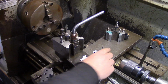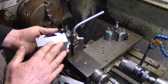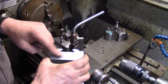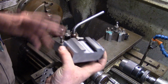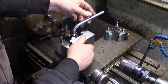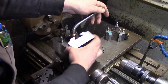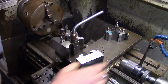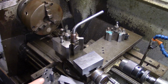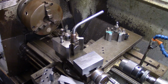But anyway, next video will be machining the tops of these, cleaning them all up, getting them all the right size. We'll maybe surface grind both sides. We've got 4 or 5 of the big ones, we'll machine them all the same size. Going back to that bit there that I ballsed up, you can see what I mean. Look, it doesn't affect the tool holder at all, as long as it's got that bit there to pull on. So yeah, cleaning them up, then we'll have to start to make some decisions on what tools I'm going to put in where. Machine the slots out of here, and then loads of drilling and tapping.